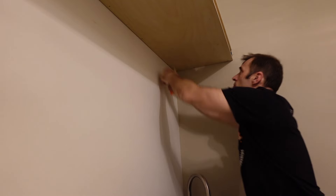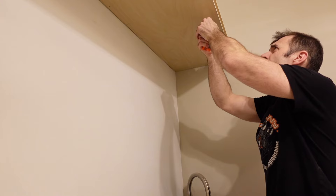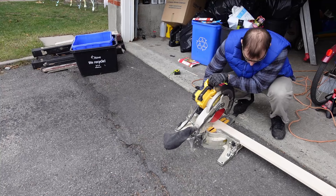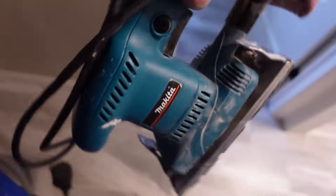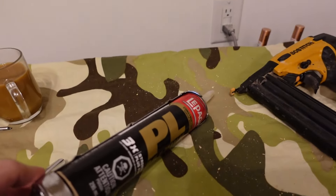I find that you can see the wood filler a little bit more on the plywood than on solid maple boards — on the solid maple it completely disappears, but on the plywood it makes a bit of a light spot, which I wasn't too happy with, but it's not that big of a deal. Now I'm using a four-inch maple board up front so it looks like it's all a solid maple shelf. I just cut it to length with the miter saw and used a sander to sand it down to the proper width — it was only off by less than an eighth of an inch. I just use this Makita palm sander; it takes a little bit of time but I don't have to worry about running it through a table saw and getting any damage. About 15 minutes with the palm sander and it's right down to the right width. I also pre-sanded the board outside.